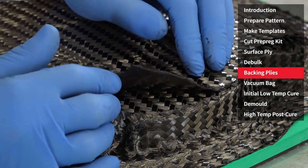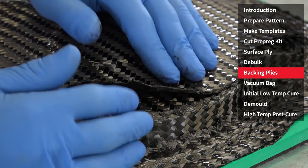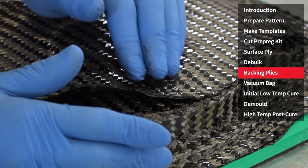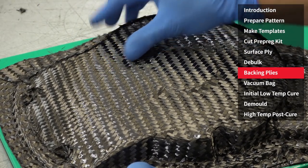When making a mould, it's quite different to making a component — you only actually need a very small overlap. So although we've got lots of pieces here, you can see we just retain adequate strength in the mould by having a very slight lap of the join.